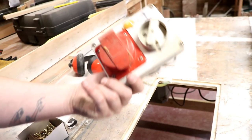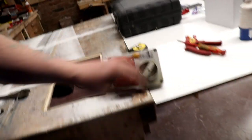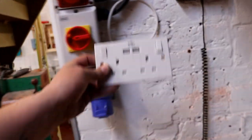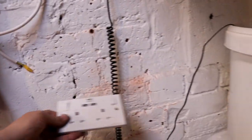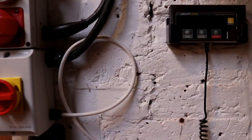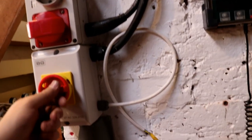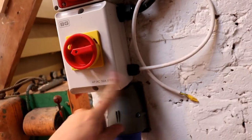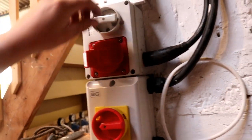So that took considerably more time than I anticipated. We've got spent and broken - this is the one I've replaced because it was knackered. All the spent wire on the floor there is from cutting off the armoured cable, same down here. There are the new set of boxes. I am actually going to put a little USB outlet just there to plug the scales in, but I don't have any double-pattress boxes, so all I've done is taped up the end of that cable - it's off and isolated. And of course we've now got a proper three-phase unit that works.